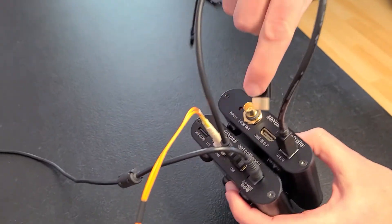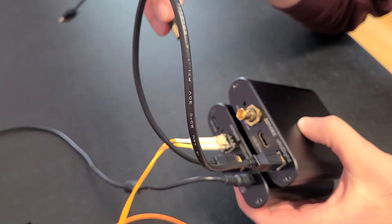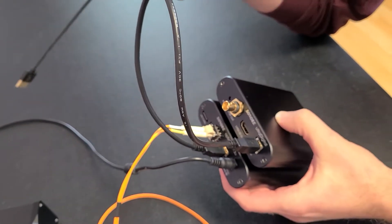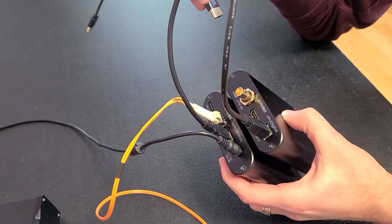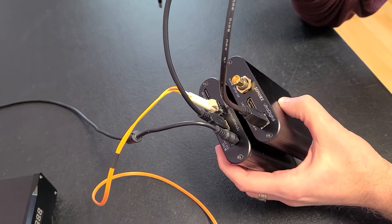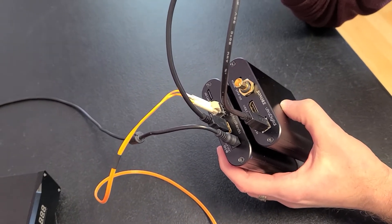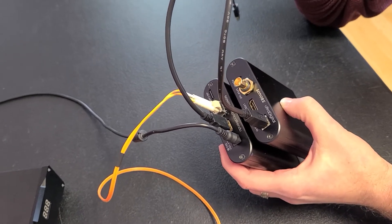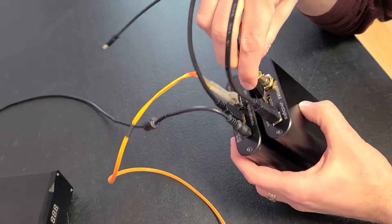This is my HDMI cable here. Again, we're not sending a video signal over this — we're using an HDMI cable to send I2S, which is very similar to SPDIF, but it allows you to talk directly to your DAC chip. So you're bypassing the USB chipsets, bypassing any streamers in your DAC, and going directly to the DAC chip. It gives you the cleanest path, and with most DACs it gives you the best sound.